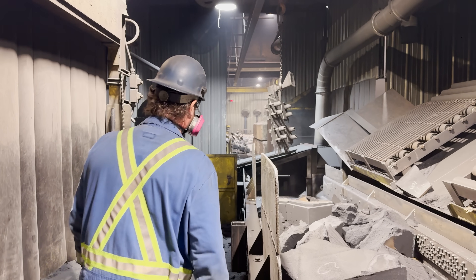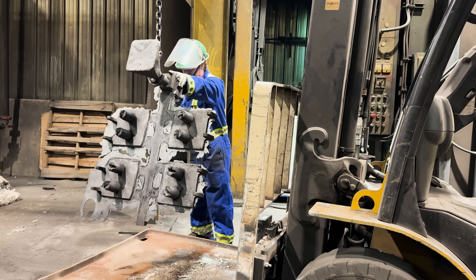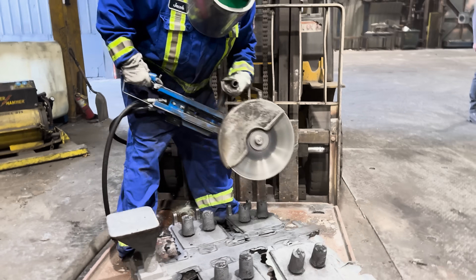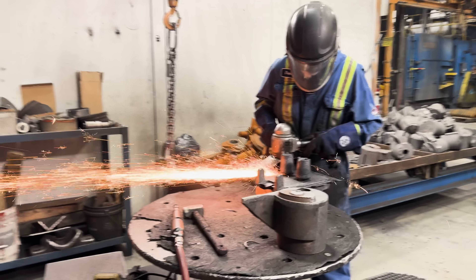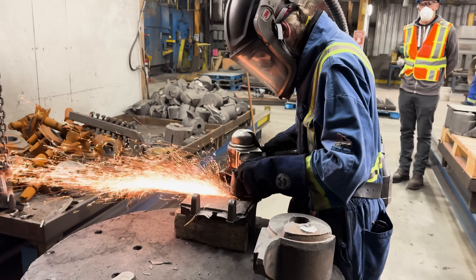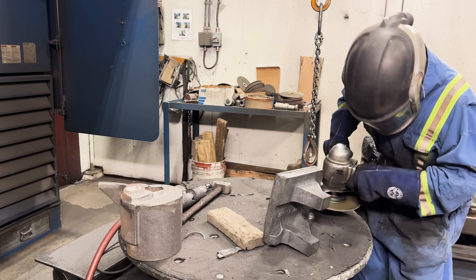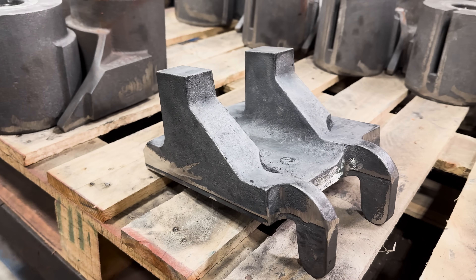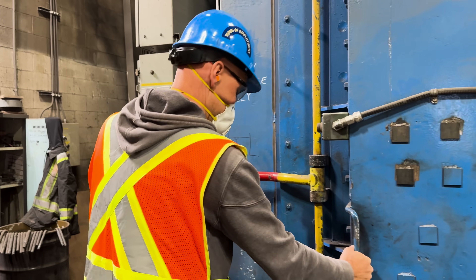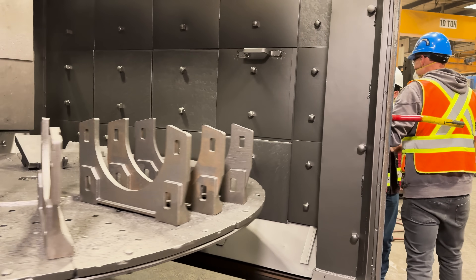Make sure there's no damage — whatever you have in the pattern is what's going to show up on the casting, so it's the molder's responsibility to make sure it's as clean as it possibly can be. Once that's shaken out, you're going to watch Jacob cut the runner bars and separate the castings from the runner bar. From there we'll go over and watch the grinder clean up any flashing or parting line, and remove the risers from the casting — so you can see the nice finished product. As a final step, we run all our castings through a shot blasting machine using steel shot, which gives our castings a nice surface finish and cleans up any remaining sand.